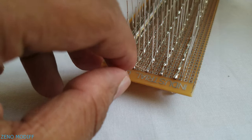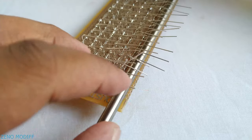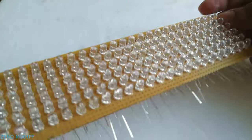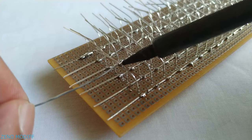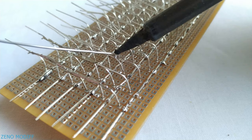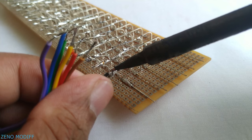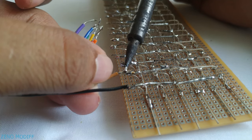Insert a 3mm steel rod to the first row, then bend the leads of the LED to short them column-wise. Now around 25% of the LED matrix is completed. Hold all the cathode legs properly to short them together, the same way we have done with the anode legs, to get a proper joint. Then carefully solder all of them in the same pattern. Solder ribbon wires with 8 pairs to the end of the cathode legs so we can identify them all by color.